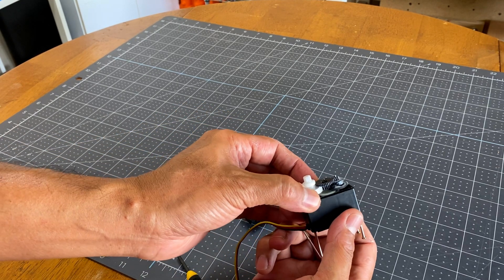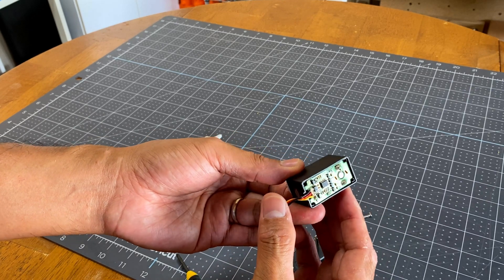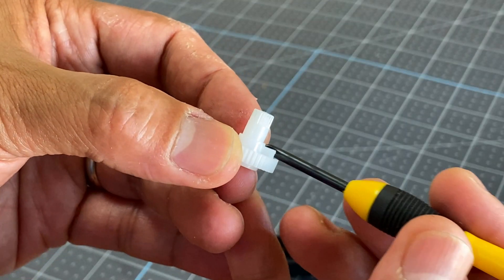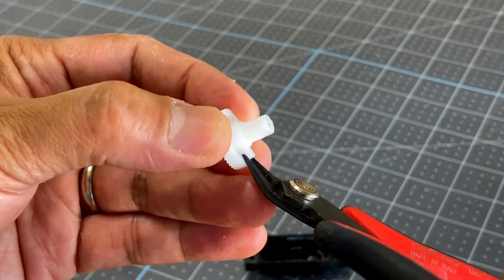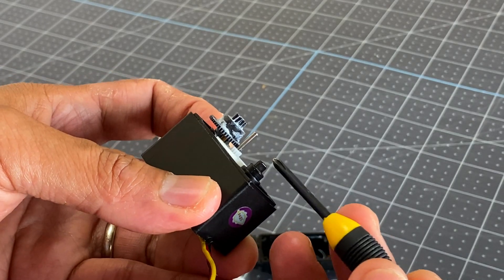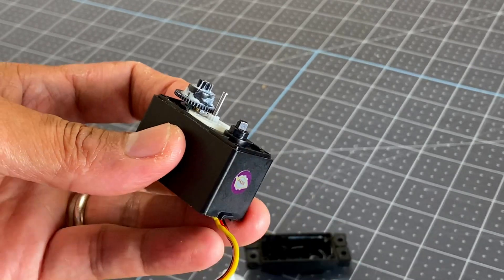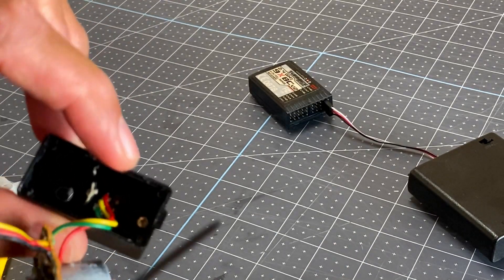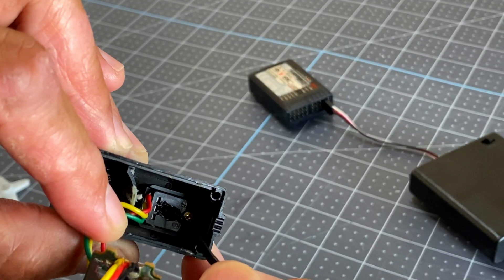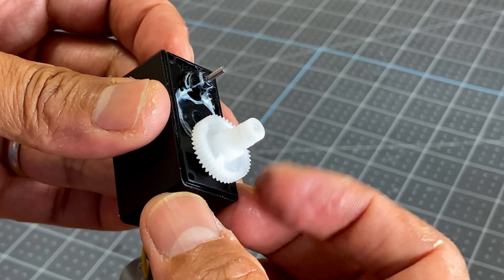Once you open it, you will see gears on the top and the circuit at the bottom. The first step is to remove the mechanical stop on the main shaft that physically prevents it from full rotation. With the use of a transmitter and receiver radio, adjust the potentiometer at the center until the motor stops moving. Then carefully glue the potentiometer at the bottom to prevent it from moving. Only then you can cut the potentiometer shaft. Now your gear is fully decoupled from the potentiometer and can rotate freely.